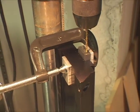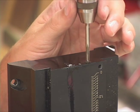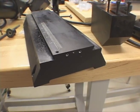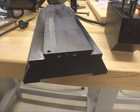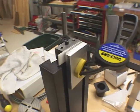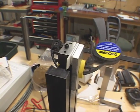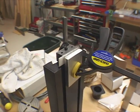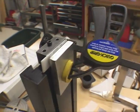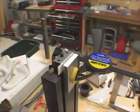Going ahead and drilling these holes. Alright, there we go — we've got the holes complete for the base. And for the x-table, to put the template on there, I had to come up with a couple of little plastic shims and a sheet of aluminum cut to cover that distance so I could square that up. I tightened down the nut and little screw, then measured it and made sure it was square, and clamped it with a little vise grip — seemed to do the job. All ready to drill and tap again.